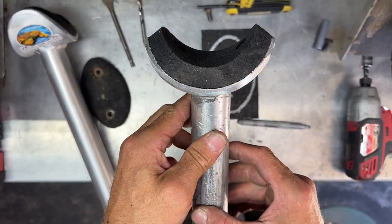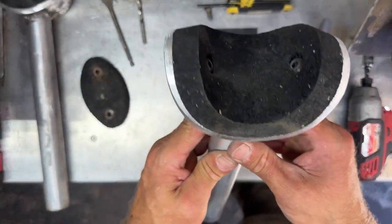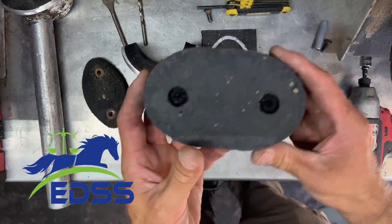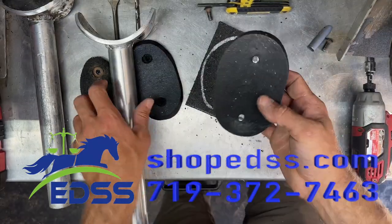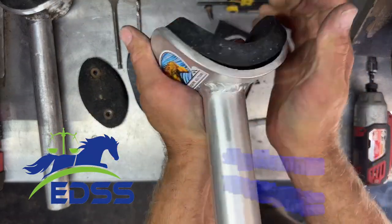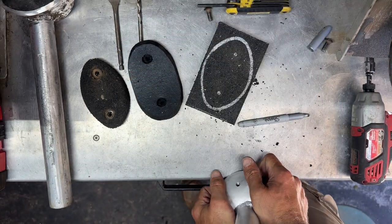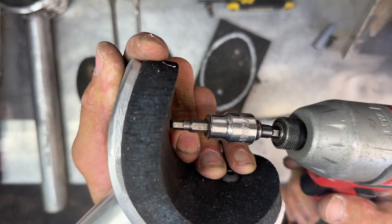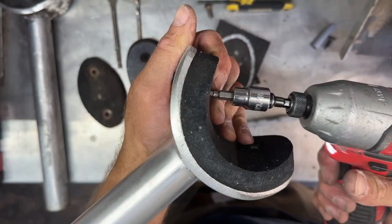So this was a nice way of making your own rubber insert for your Equipost cradle. However, ETSS carries the rubber inserts already made up, so all you have to do is install the bolts, remove your old insert, push in your new one, and line the screw holes. Sometimes it's a little tricky to get a click in, so I use my allen key to align the bolt with the hole and then go ahead and screw it in.